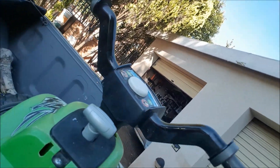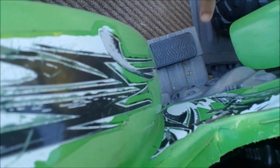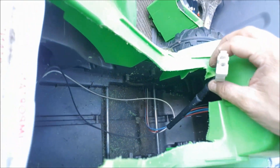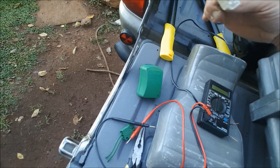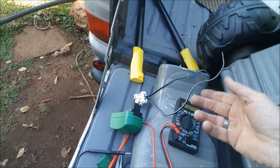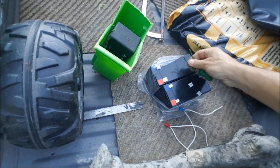I'm going to give you an interior view of the bike. These two wires here are running to your motor which sits at the back. Then those three wires there are your switch, which is your pedal — so that's opening and closing the circuit. None of the power plugs change — we keep all the power plugs the same. It's just the voltage that is going to be changing. Here's your old power supply — you can see it says six volts. All I've done is cut the cable. This came from the charger before and was tied in at the back. So all we're doing is changing the input and output current from six volts to 12 volts, and we're going to tie it into the two 12 volt batteries.